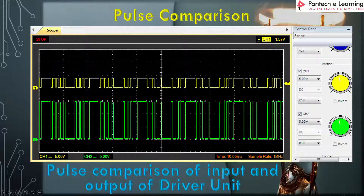Here is the pulse comparison for the 8th MOSFET switching pulse, M8. The yellow color pulse is from the controller, and the voltage is set at 5 volts per division for both channel 1 and channel 2. Channel 1 (yellow) is the pulse from the PIC controller unit, fed to the TLP250 driver board. After the TLP250 driver board, the output is amplified and isolated — shown in green — with amplitude approximately 15 volts, compared to approximately 4 volts from the controller. This waveform is derived from the PC DSO.